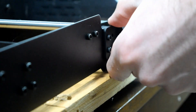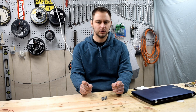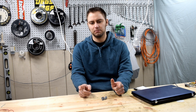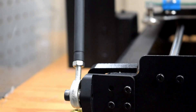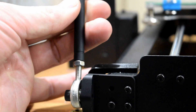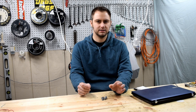I did one at a time just so I wouldn't move the printer a whole lot, and I did all the brackets right away. Then when I had the rods to stabilize it, I made sure the screws were still pretty loose on the two eyelets on the ends, tightened it down, and then tightened the jam nut on the ends to make sure the rods are fully stable and secure.